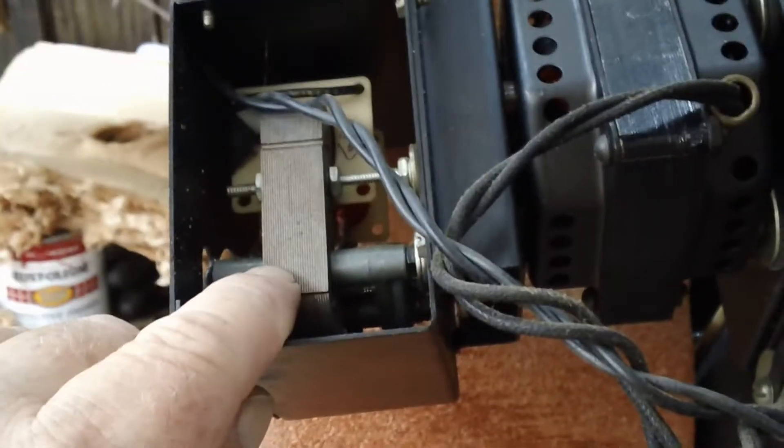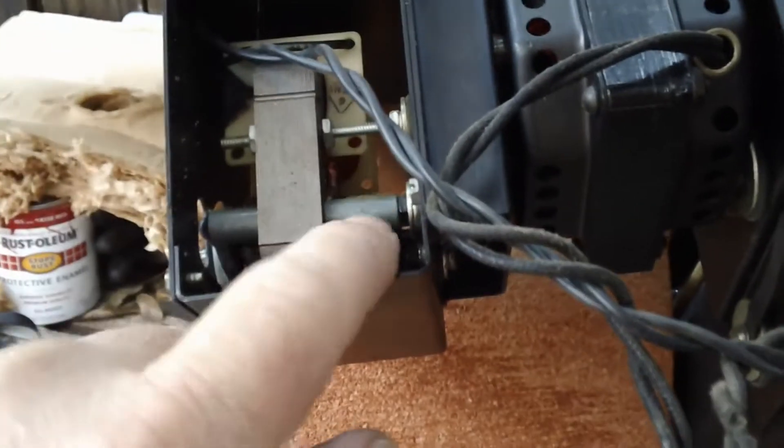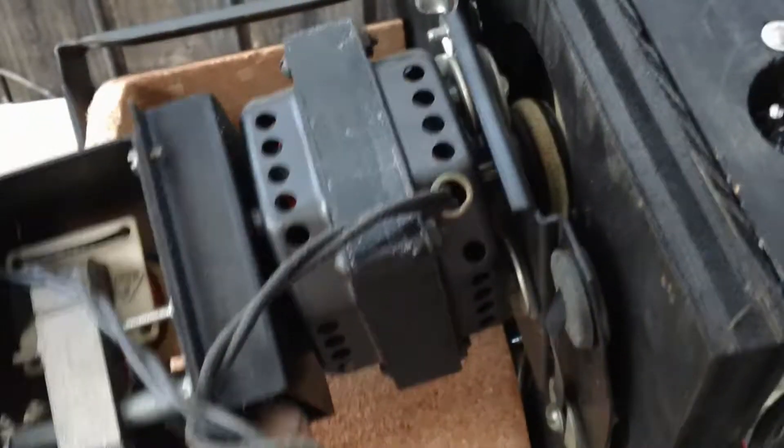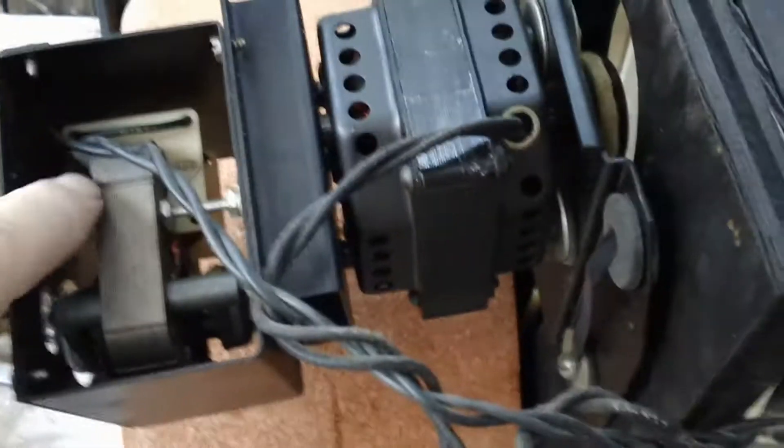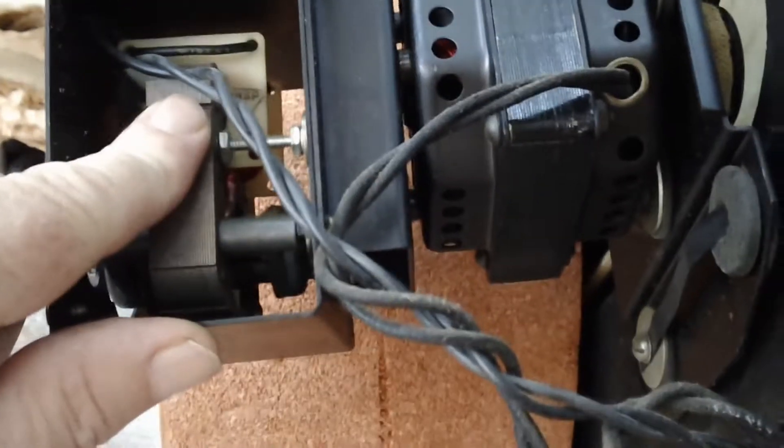In a moment I'm going to give you a view of the low-speed motor. It kind of looks like a little fan motor — that's what they're generally used for — but this one has a shaft that's a lot longer, and it's going to go up into the assembly where the wheel is located, geared down for slow speed. Whenever I go to low speed, this one will be fed electricity, it'll start spinning, and the shaft is going to push to the right and engage the little wheel.